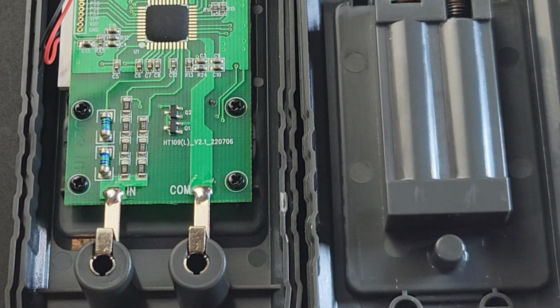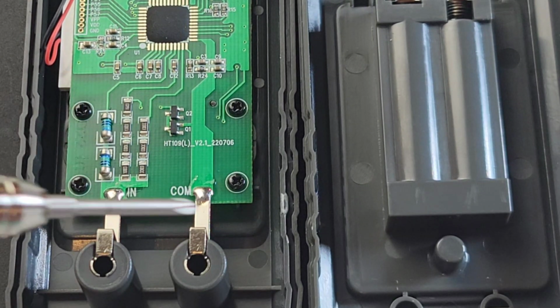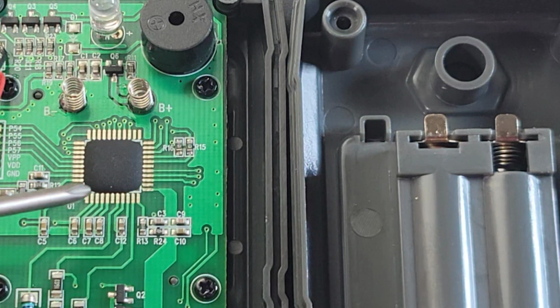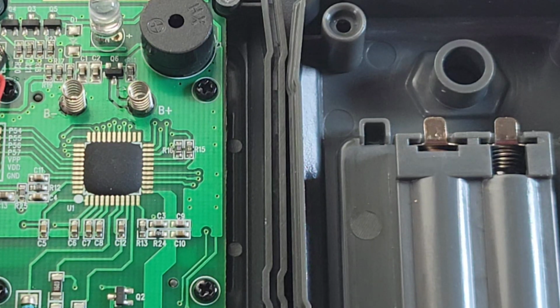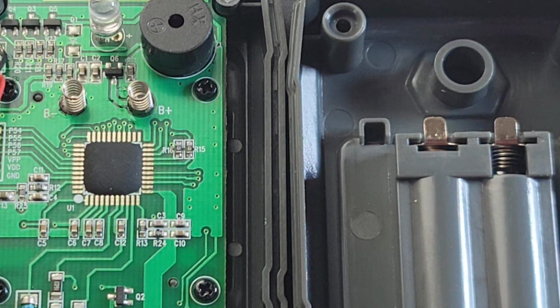And you know what? We have 6 Phillips screws holding in this tiny PCB to the case. Wow. The main package itself is COB. Here is our program selector for factory calibration. There are the wires for the backlight display, LCD for the flashlight, and the spring connectors for the contact with the batteries. There, of course, is our speaker. So pretty slim pickings all around. Let's take a peek on the other side.